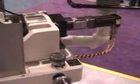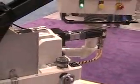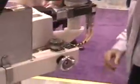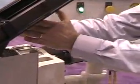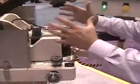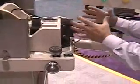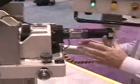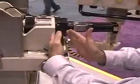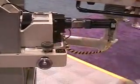The machine is also capable of a through-feed grind. To set up and chase the taper from a part, the entire ram bed can be swung with the hand wheel, sliding the ram bed to the back end to incorporate the work rest holder with the regulating wheel housing and the full ram bed — for chasing taper out of a part or, in a through-feed grind, for setting up the stock removal or the funnel opening of the wheels.